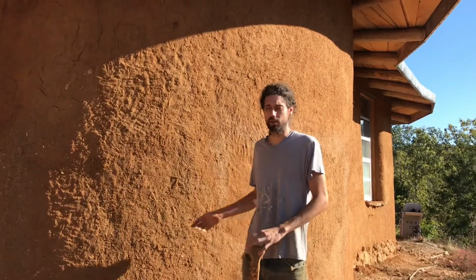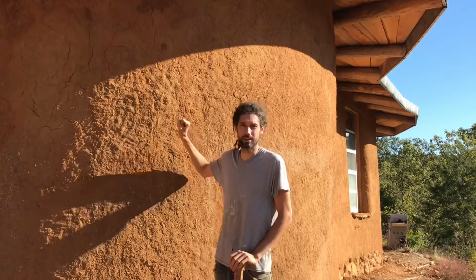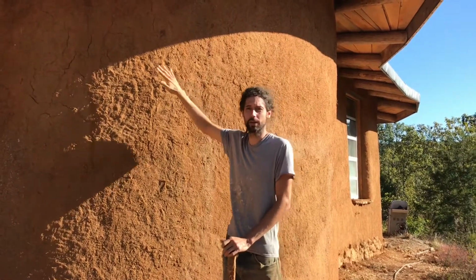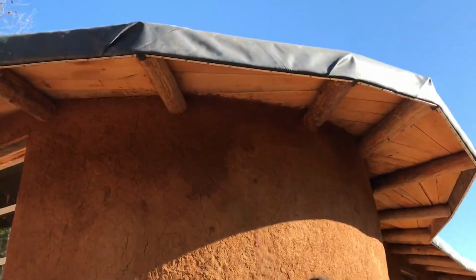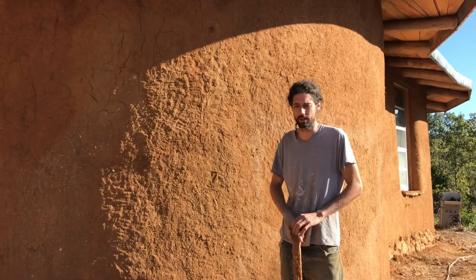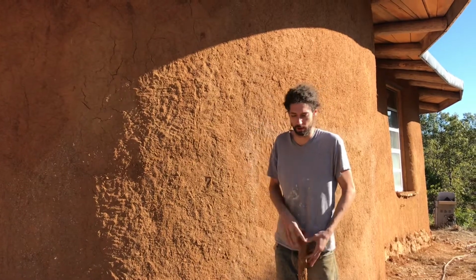After we built the straw bale walls, put a top plate on, ran strapping up and over that top plate, then we tightened with a strap ratchet to pre-compress all the straw bales so that when we put the roof on it, the roof does not further compress the bales. We put a rubber liner on top of it so that we can put a living roof on there. The rubber roof allows you to work with all sorts of shapes and sizes, whereas with shingles and steel it would have been quite hard due to the nature of this reciprocal roof that we put on here.